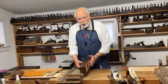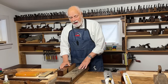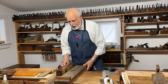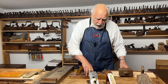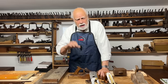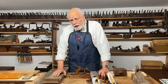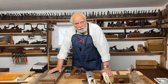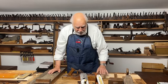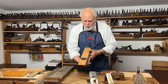Now let's look more closely at the irons. If you sharpen the iron properly, no matter how thick a shaving you take, you want to be able to plane any piece of wood in any direction. Forget the idea that you should always plane with the grain — wood is not that convenient; very often the grain goes in all sorts of directions. But planes, if properly set up, can plane in any direction. Let's look at the bottom of this plane.